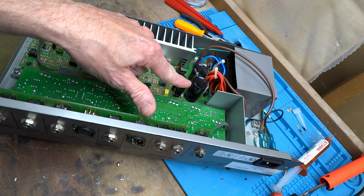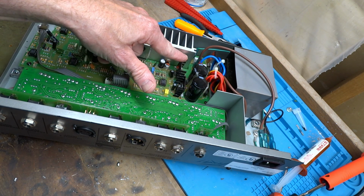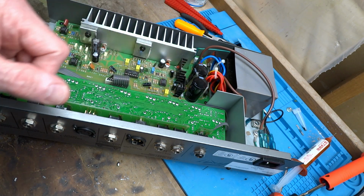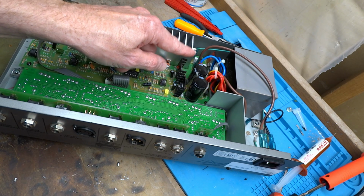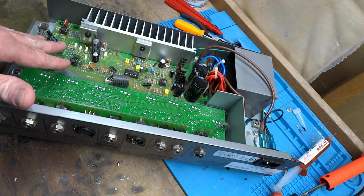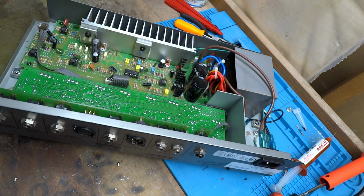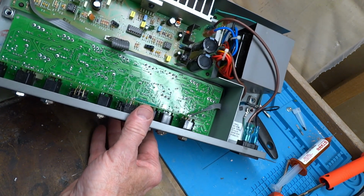Of course, I still have to secure the original problem so the problem doesn't return again. That's those 2 heat sinks on the output transistors. I'm sorry, not the output transistors, the voltage regulators. But I believe if I do that and I do what I want to do over in here, this amp has a good 20 years trouble-free ahead of it.